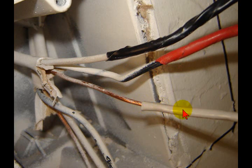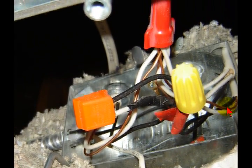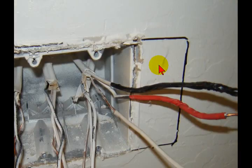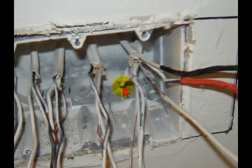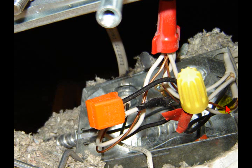Here's a close-up: the white wire is taped black, the black wire is taped red, and the insulation is slid over the ground wire. Up in the recessed can, they had taken the ground wire and tied it into the neutrals. So the ground wire is now acting as a neutral, and there is no ground up at the can.